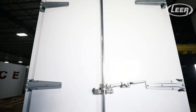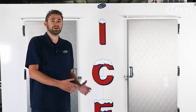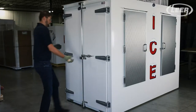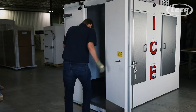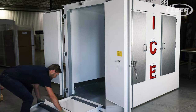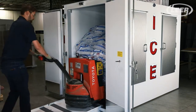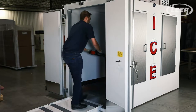The PL225 is a very simple and efficient merchandiser to use. To load the merchandiser, first use a pallet jack to wheel the pallet device towards the merchandiser. We highly recommend using an electric pallet jack, although a standard pallet jack will also work. Open the transport style doors, remove the ramp sections, and assemble the four pieces. Wheel the pallet device up the ramp, aligning it with the opening, and gently push it into the merchandiser. Repeat for the second pallet.